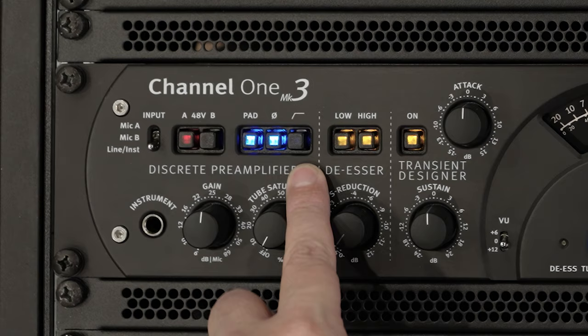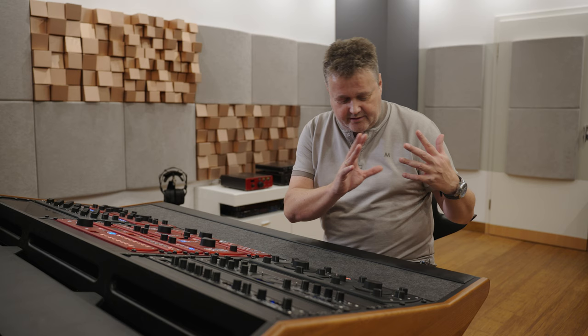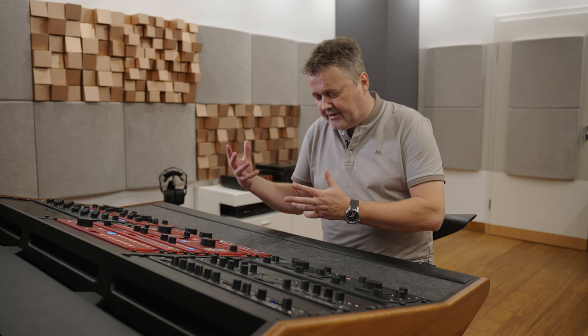The third function is the high pass filter, which prevents all of the low-frequency noises — touching microphone stands and stuff like that — from entering the recording. This is a filter that rolls off from 70 Hz downwards, so that the very low frequencies are out of the way and you have a much clearer recording. It also removes the levels coming from these very low frequencies, which are usually driving AD converters into overload easily.